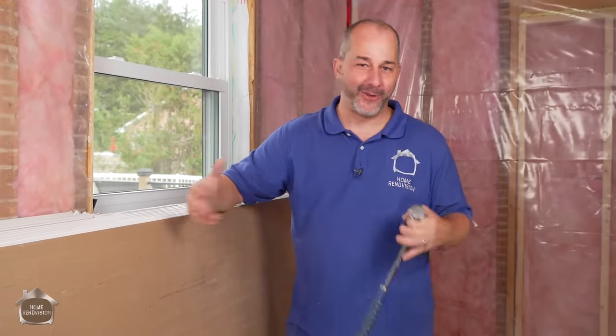Now, I know I'm going to get a lot of comments from contractors out there going, oh, we just lift it up and hold it, somebody else screws the board. And that's great if you've got 2 or 3 guys on your crew. But this system works amazing for homeowners. You might be by yourself or have one guy helping you and you're not used to working with it. You don't want to be lugging that around and causing yourself injury because you're using muscles you don't usually use. So rent a drywall lift if you need to.